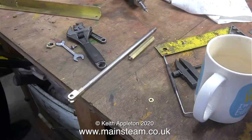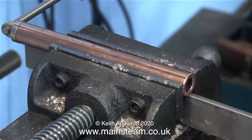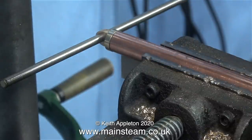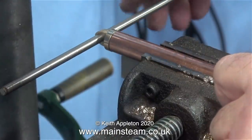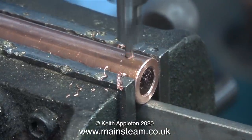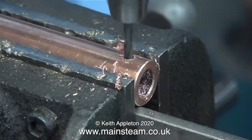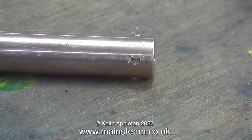Here's the original piece of stainless steel that I put together as an experiment, with a threaded piece of hexagon brass to connect it to another piece of stainless steel because it wasn't long enough. I need to make a modification to the tube that slides over the regulator - to stop it from sliding up and down I need to drill and thread four holes around this piece of tube to clamp it in place. To make sure these holes are in the right place around the perimeter of the copper tube I should really use my rotary table in horizontal mode, but that takes a while to set up. All I did was fit a piece of quarter-inch diameter stainless steel to the fitting on the end of the tube and then use my calibrated eye to sight it up and make sure all the holes were at 90 degrees to each other. Not good engineering I know, but it works for me - and this clip shows that the holes are very regular around the perimeter.